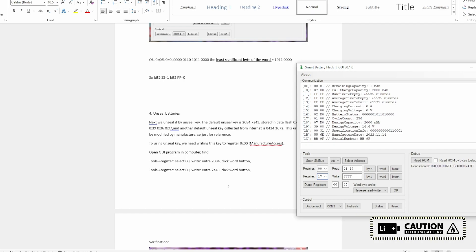You need to modify the data on the BQ4050 to make sure the battery is perfectly configured for your use. If you plan to increase capacity from 2000 to 4000 milliampere, use the same battery chemistry — do not use other branded batteries, because the cutoff voltages and other parameters are different for each battery. It is dangerous — EV vehicles are exploding or catching fire, and we read about it in the news every day due to charging problems or short circuits.